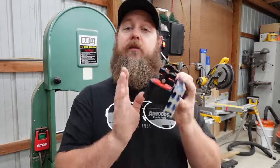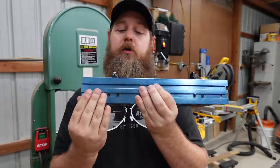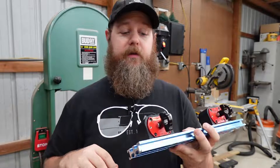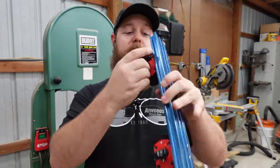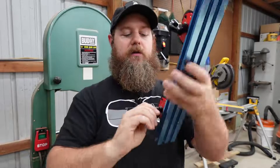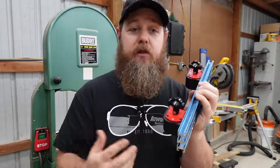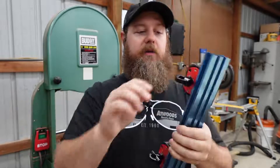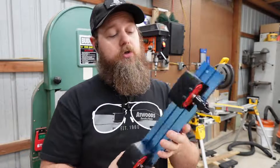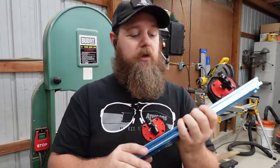The first thing I did is 3D print two key components. I got this extruded aluminum from Powertech on Amazon, and I'll leave links in the description to everything I purchased. I also purchased these magnetic clamps. You can turn them on by just pushing down and turning this dial here, and that activates the magnet — it pulls down. These both have 180 pounds of pull force, versus some others that are around 100 to 130. So this gives you a lot more locking mechanism.